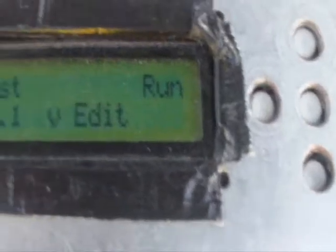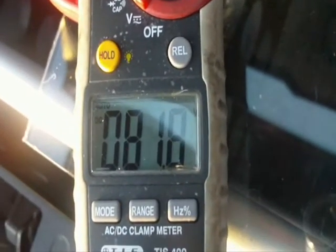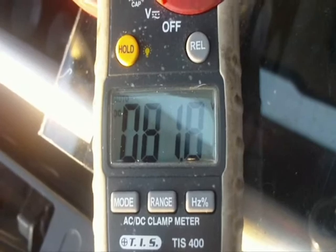You can see a little white box down there — that's where our brake pump is now installed. You can see we've got lots of space now that the vacuum pump is gone, which is now installed in the front tray. Just for a final check, we've got 82.1 volts with the charger turned off. Running back to the back, we've got about 81.8 volts. So that's it — pretty good charger.